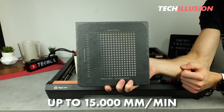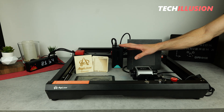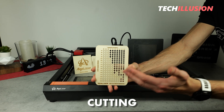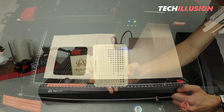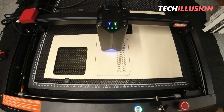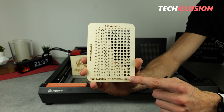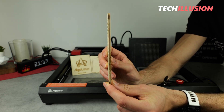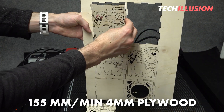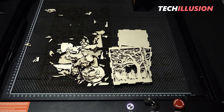Due to the powerful 20-watt laser module, it's also possible to cut materials like wood, metal, or plastic. I've also prepared a detailed laser test board for you. As you can see, the speed is significantly reduced from 80 to 155 millimeters per minute. Even at the high speed of 155 millimeters per minute in one pass, it completely cuts through the material, which is 4 millimeter plywood. I wouldn't go beyond 155 millimeters per minute for 4 millimeter plywood. By the way, the laser is rated for up to 12 millimeter plywood in one pass, but you have to significantly lower the speed for that.